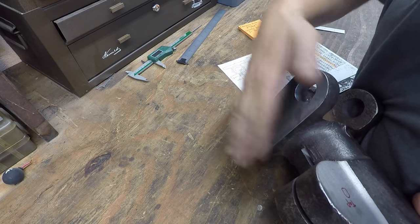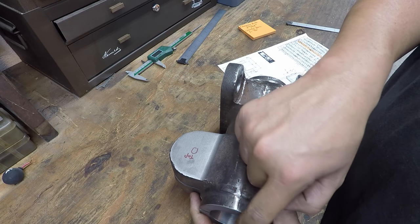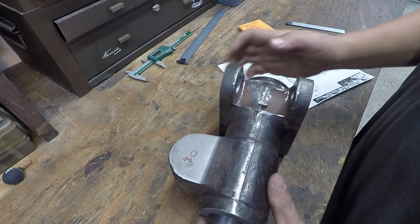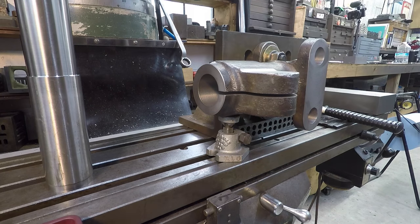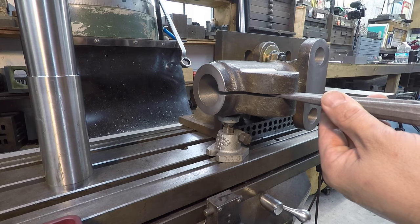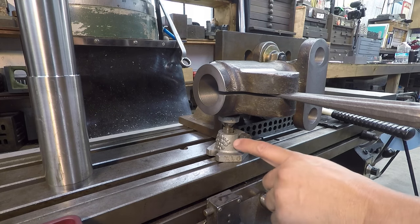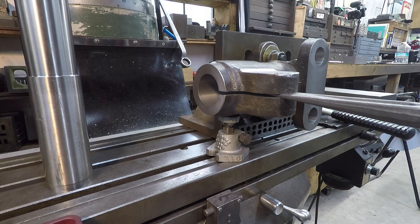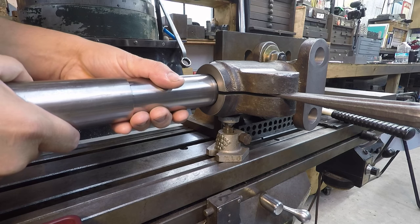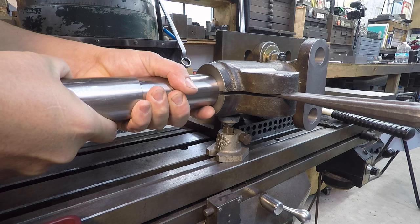Probably just pull it up on an angle plate on this side right there. That way I can find the center this way, and then offset it to the center point of where the hole's got to be. We'll go ahead and get our bar in there. I'm just going to use this wedge and just ever so lightly spread it. I do have a jack underneath there too to help support the downward pressure that we'll be putting on this piece here. Get it started straight.